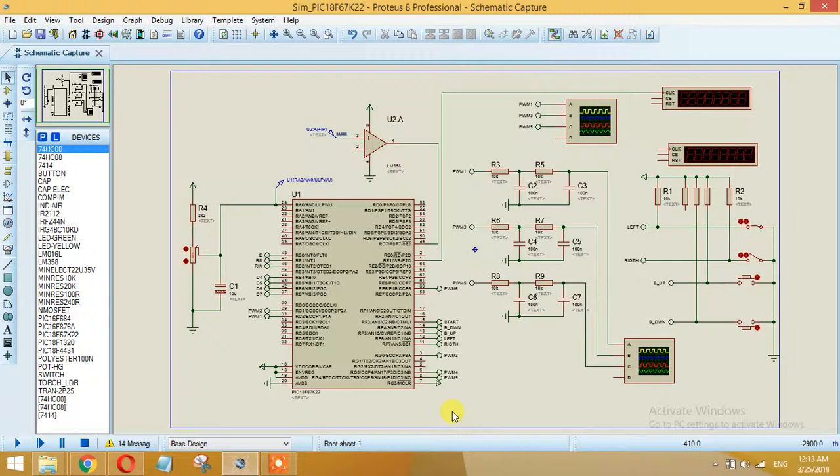What we are doing here is: suppose we have a single-phase or 3-phase incoming supply. The first thing we do is convert that supply into a DC supply, charge our capacitor banks, and after that we convert that DC back into 3-phase AC according to our requirement.